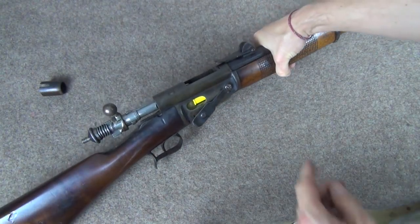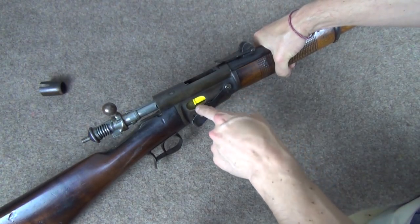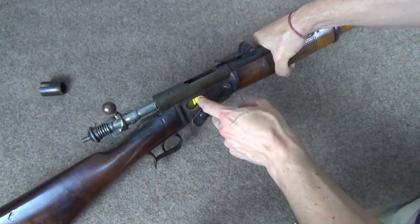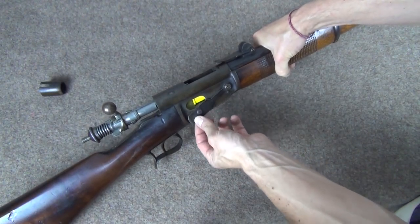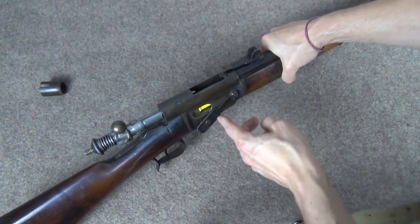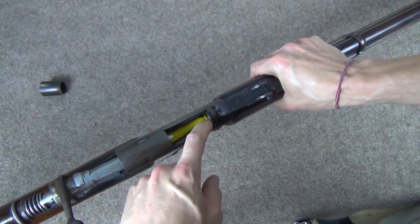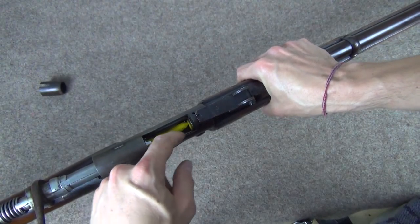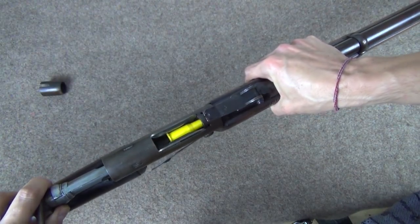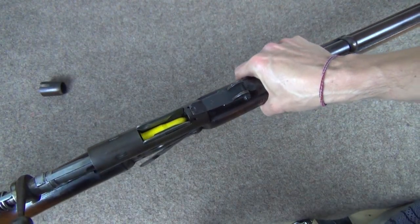That's how the cartridge sits there. It's a bit odd to see the back of the cartridge just exposed like that, but it's being pushed up hard against the back surface, and of course the cartridge column or the follower ensures it actually goes nowhere — which is basically why they rendered that flimsy piece of spring steel utterly useless. When we look down into the magazine we can see the rim of the next cartridge is actually poking into the magwell. As mentioned, this isn't an issue because that sloped surface on the front of the lifter pushes it back — you can see it disappeared and the magwell's clear.